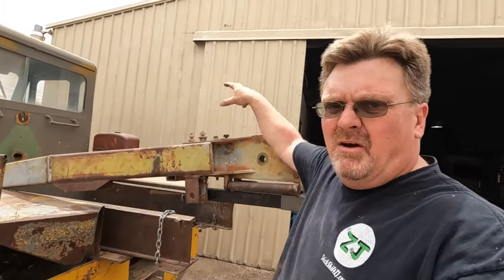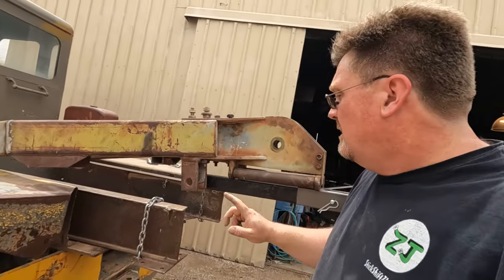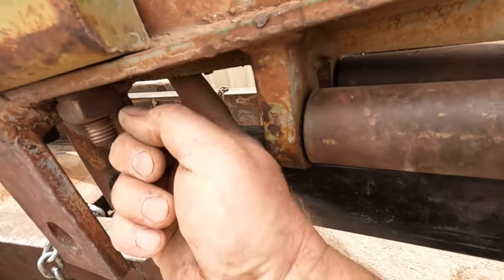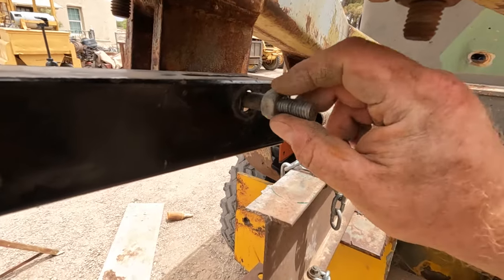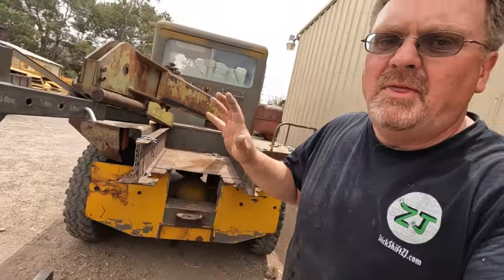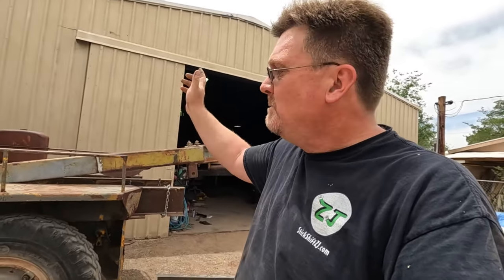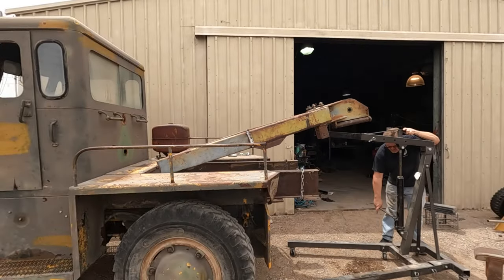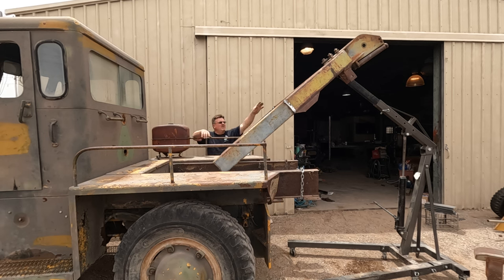I couldn't get the height I needed with the hoist above this arm and the chain hanging down, so I need to push from below. But I don't want it to fall on my head because I like my head — it's useful. So I flipped this arm upside down to where the chain normally comes out is pointing up, and where the bolt was I ran a long new bolt all the way through. That plate is now bolted to this arm for a sloppy fit that should let it pivot. As I go up, that should hold it quite securely — it can't come off the hoist — but still let it flex so I can move it around. I want the top of that arm about level with the roof so I'm not adding any height but still getting as high as I can.